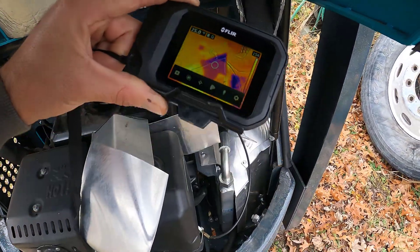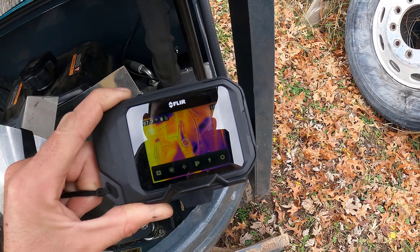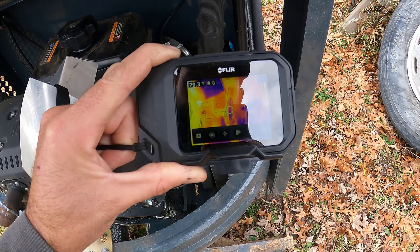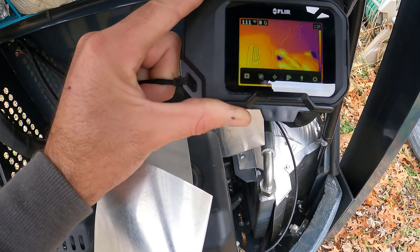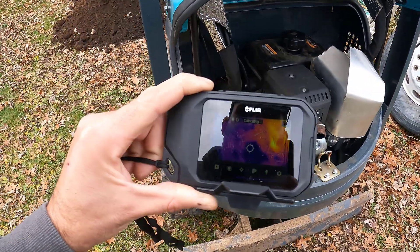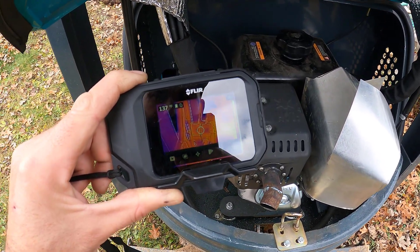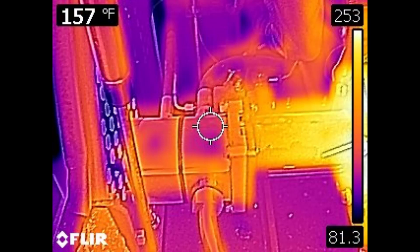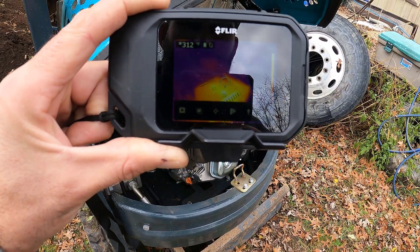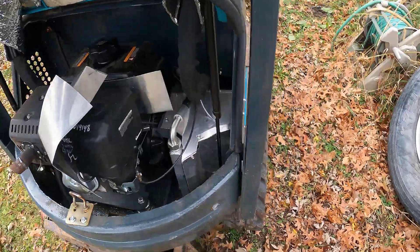Can you tell the difference between hoses on the hydraulic cooler? This one's a hundred and it's going down. That one's 120, 110 - it's pretty good heat reduction. The pump's nice and cool, I guess 135. I'm going to run this some more and see how hot everything gets. The gas tank is already 120 degrees.